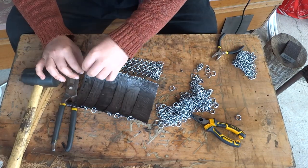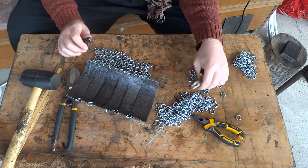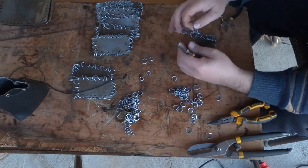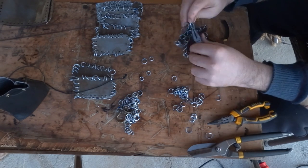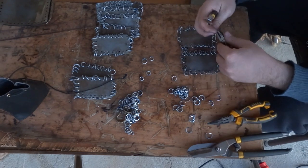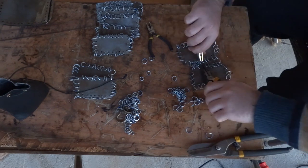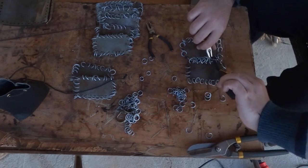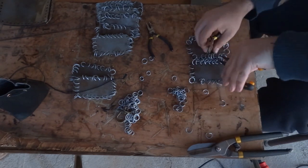Now, as you can see, I start combining plates with mail so it covers more flexible areas. Mail protects all the vital areas that need to be flexible or can't be protected by plates. In this plate-and-mail style, a layer of mail sits between the plates, which is much more flexible and resource-friendly. It takes much less metal to place them side by side and combine with mail than to overlap them. And if you're already making mail, it's a great way to save resources and time by putting some plates in between for visual decoration — but don't forget it's also a lot of work to make perfectly aligned holes for the metal plates, so keep that in mind.